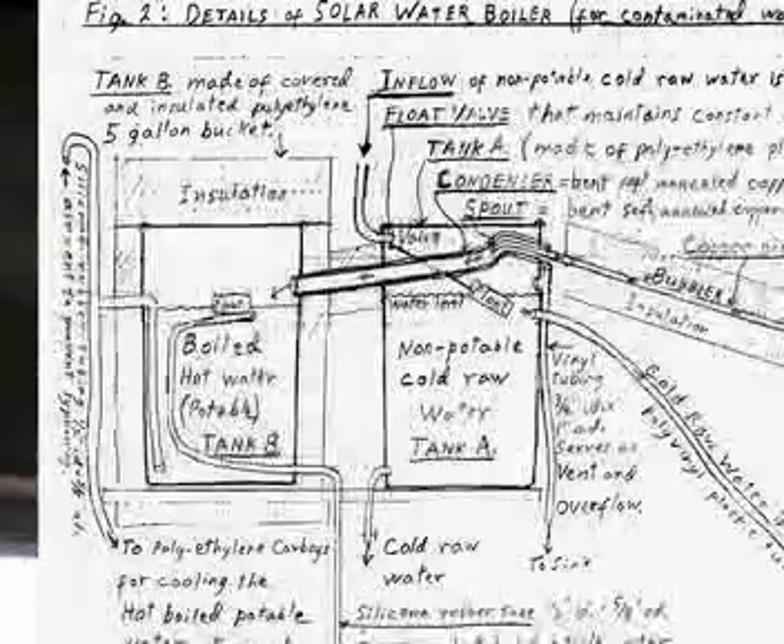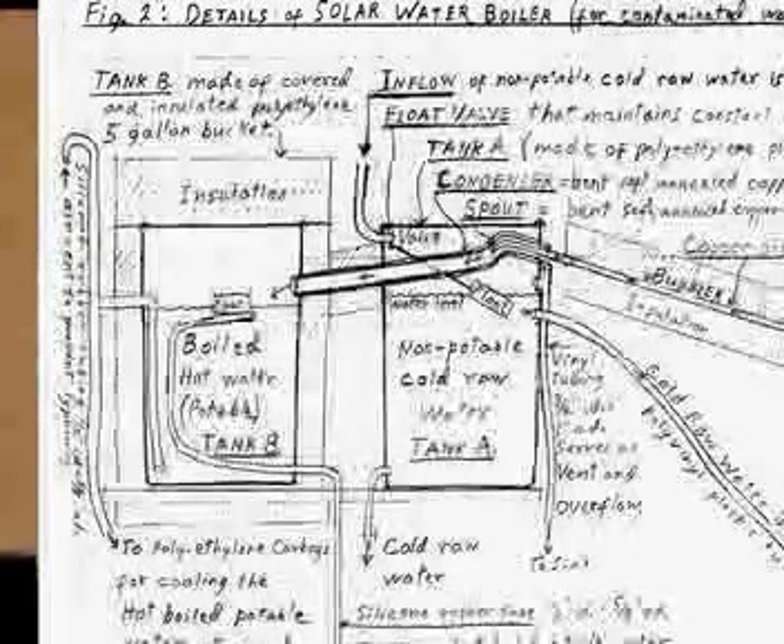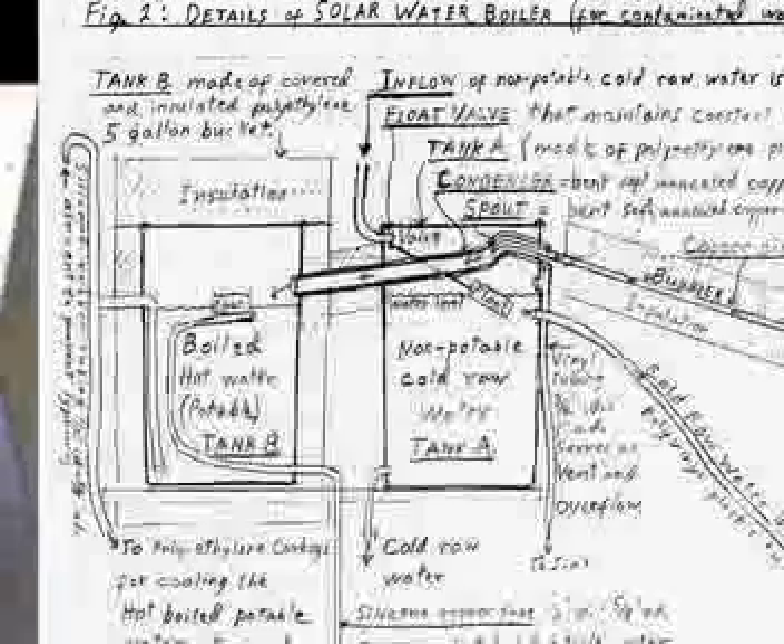You find no smell. And you have it vented — that's what the chimney is? Yeah, this is the vent. And then this other line? That's the hot water coming up into these tanks, from the pasteurizer and from the boiler.